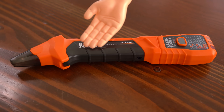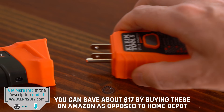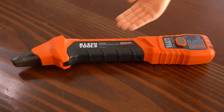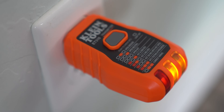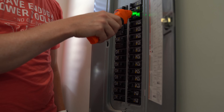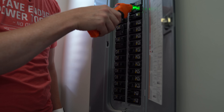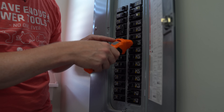That's where a tool like this is so time-saving and valuable. This is called a digital circuit breaker finder, and it comes in two parts. You've got the transmitter, which can just plug into an outlet, and then you've got the receiver, which will help you identify which circuit breaker is being powered by the transmitter. For outlets, you simply plug the transmitter end into the plug you want to identify. Not only does this communicate with the receiver, but it also verifies that the outlet is wired up correctly — it's got light patterns to help you understand if the neutral is present, if it's properly grounded, if it's even working at all. Then you scan the circuit breakers with the receiver once in a learning phase, and on the second pass it pinpoints the exact circuit breaker. With this, you'll be shutting the power off to the correct breaker every time.